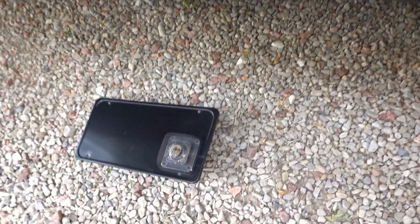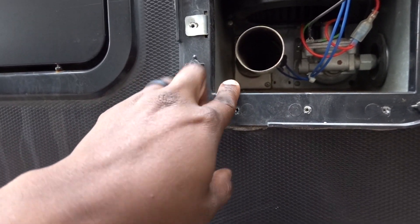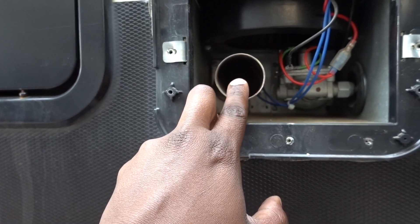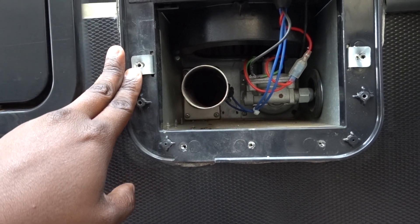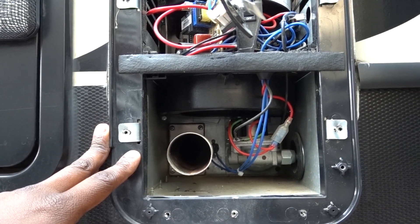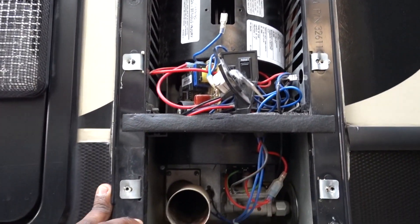It's not hard to do. There were four screws on my Dometic cover for the back of the furnace — you take those off — and as you can see, this slides out of the exhaust and basically comes right off. My RV tech said all you have to do is blow some compressed air inside of here, and that should be enough maintenance until you need to do major repairs. The good news is everything is pretty much on the outside, which makes maintenance a lot easier. I do like what Dometic has done — everything is where you'd want it to be.